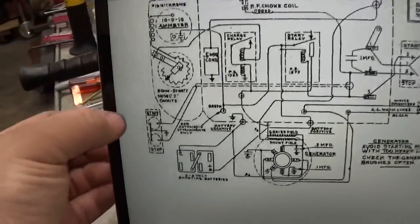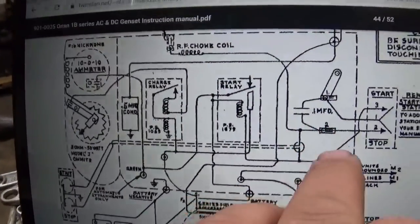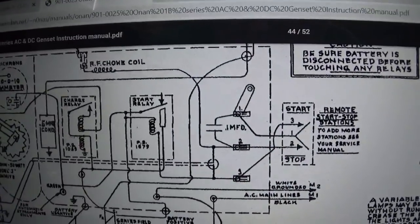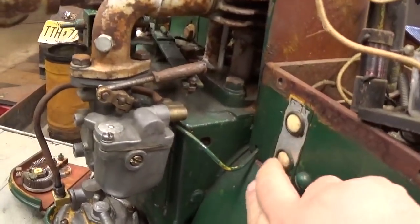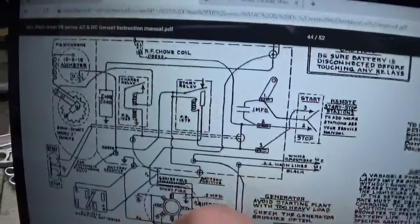So we got the start and stop button here. This is what's located on the plant. This would be these two buttons right here. And then, yeah, that condenser is between number two and number one. Number two is stop, and number one is ground. So again, I imagine that's just for kind of quenching of the arc that's produced when you release that stop button. Interesting that there's not one on the start button as well, but